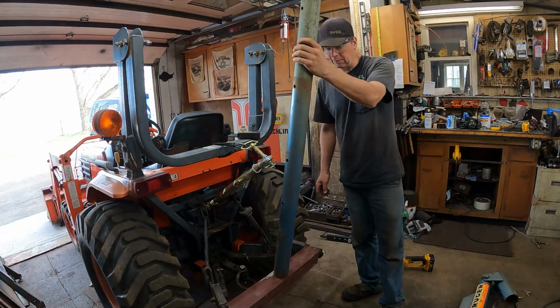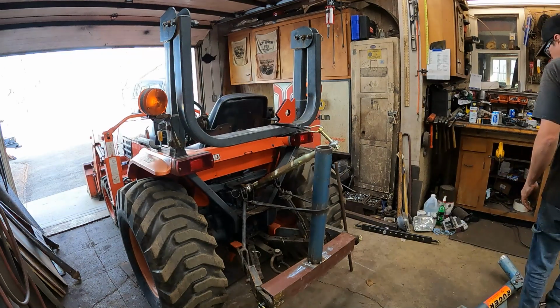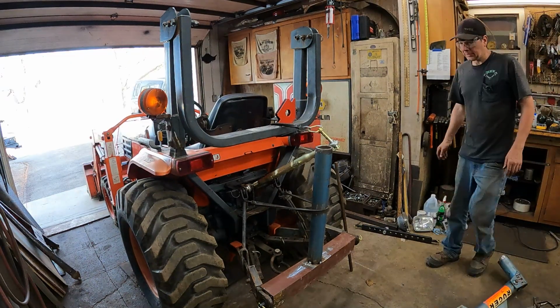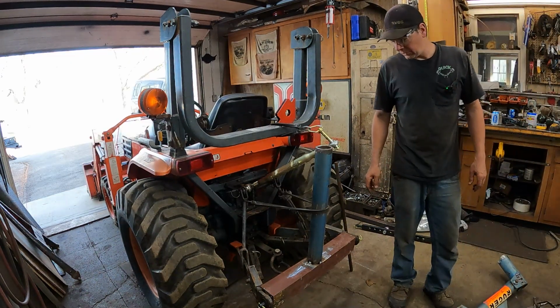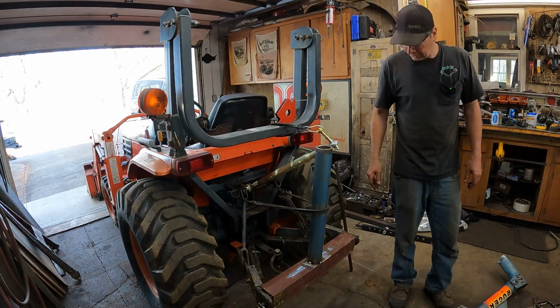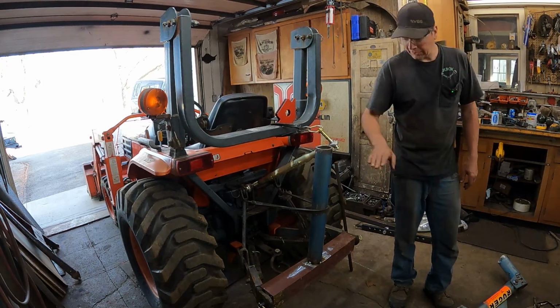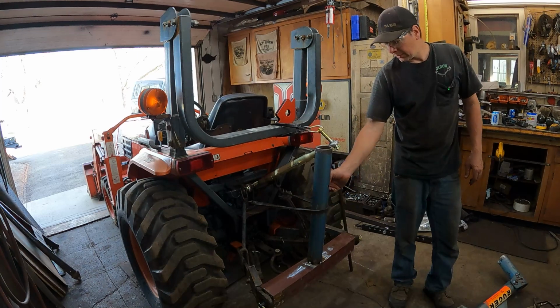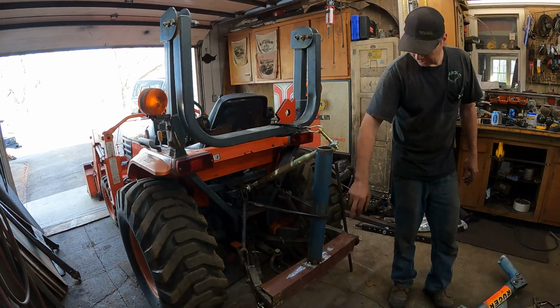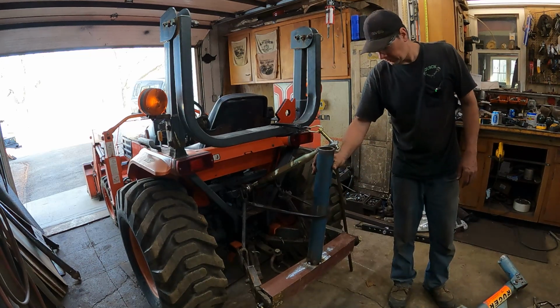and I think we will weld this sucker right on here. Okay, I cut the tube and tacked her on. I found some dimensions online, about 22 inches, what seems like some of the jib poles are like. So that's what I made this. The collar piece on here is going to slip over. It's going to double weld. It's going to weld down here where this shiny part is, so I'll have an overlap here. Will this hold? I think so.